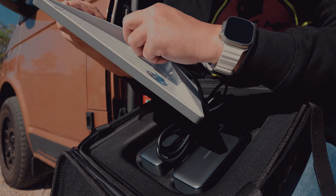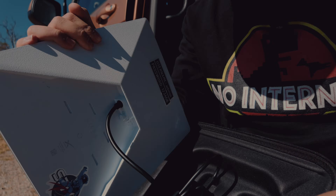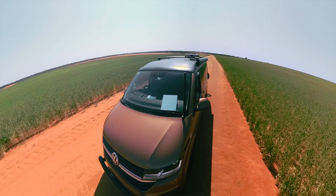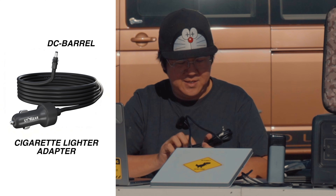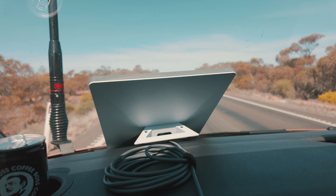Be careful though — there are many cables out there and they all have different voltage ratings. Buying the wrong one means you won't be able to draw power from your power bank, or worse, it could damage your equipment. I've linked the exact one in the video description below to save you from the guesswork. And if you're going to be running the Starlink Mini from your car, van or four-wheel drive, you might want to grab a cigarette lighter socket to DC barrel connector — this will keep your Starlink Mini powered from your car.